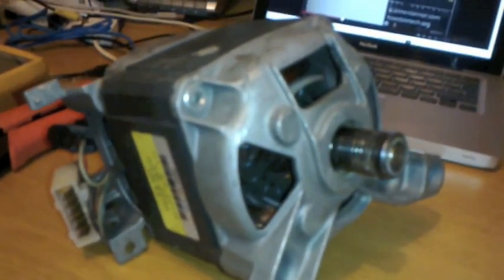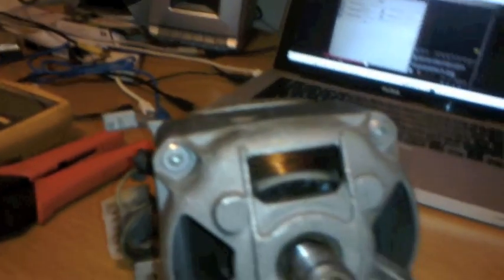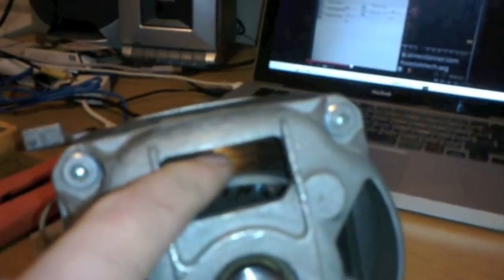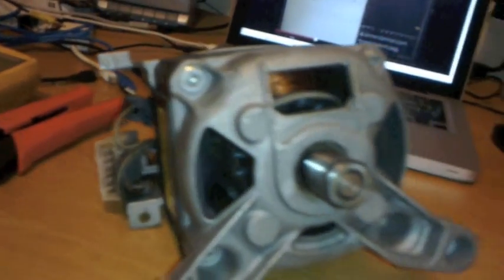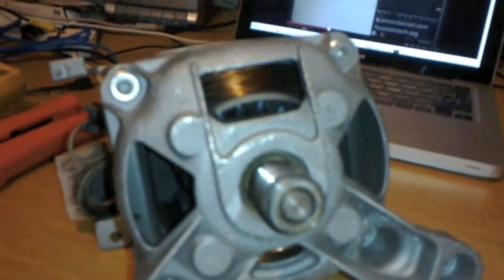You can generally recognize an AC motor firstly by the terminal block — there are anywhere from four to seven terminals on them, used for things like speed control, powering up the coils themselves, and producing electromagnetic fields to make it turn. The coils are built into the stator, not the rotor itself, which you can see turning. Normally on a DC motor you'll have permanent magnets and just send power to the brushes, but in this case you have to energize the coils themselves to produce a magnetic field.